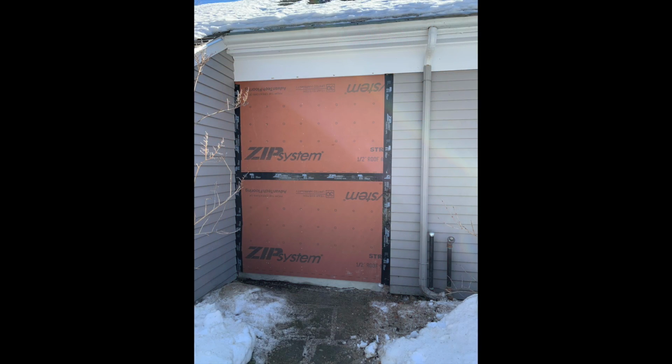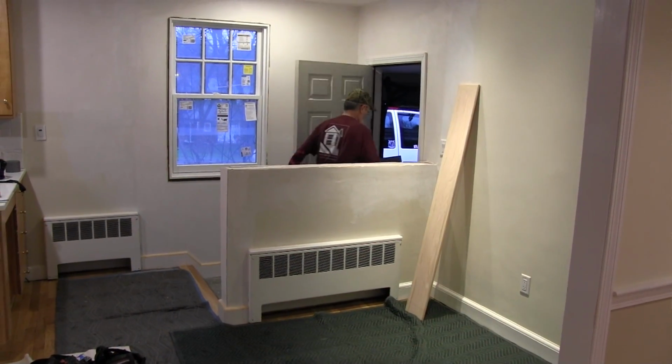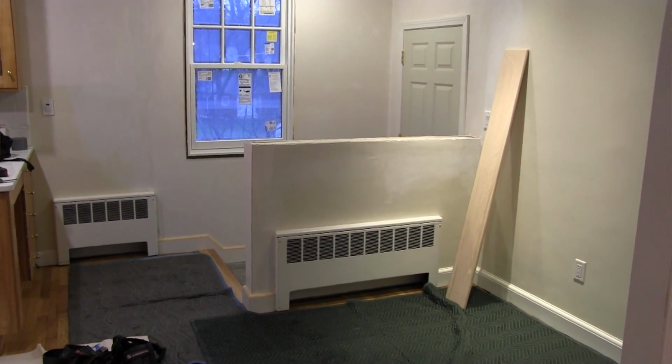But that inner wall had some electrical outlets and a radiator and a whole bunch of other components that involved other trades. So in order to save money and budget and plaster, electrical, plumbing costs, we decided to just take the wall down to a halfway point and make it a half wall, kind of a transition point. Half walls, though, are known to have flex in them. So I wanted to eliminate that or try to reduce the flex.